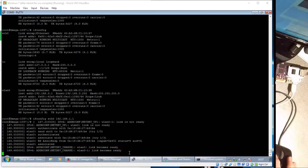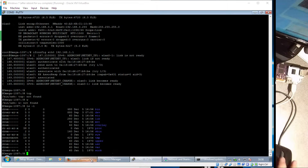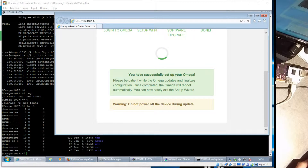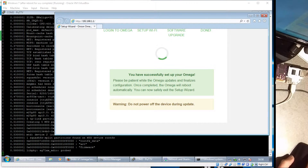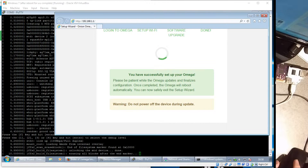It's almost to the point where I don't think it's actually doing anything. There's no output on the web browser, no output on serial, and the light on the Omega itself is not flashing. It could just be an incredibly old firmware taking a very long time. There we go — it just took a very long time with no obvious status. It's lucky I didn't unplug the Omega and plug it back in. If it gets to that stage and there's no sign it's doing anything, just wait longer, because unplugging it probably would have caused further problems.